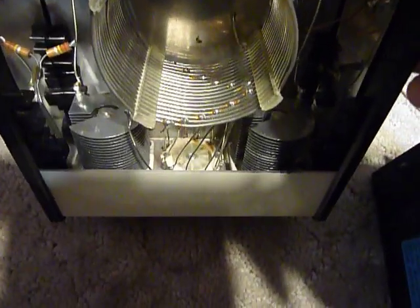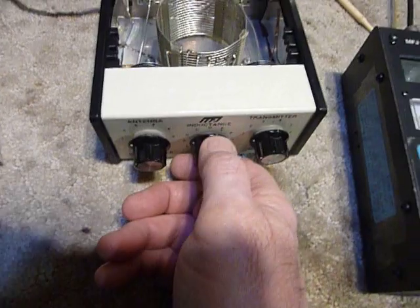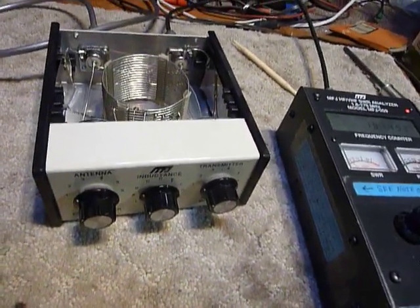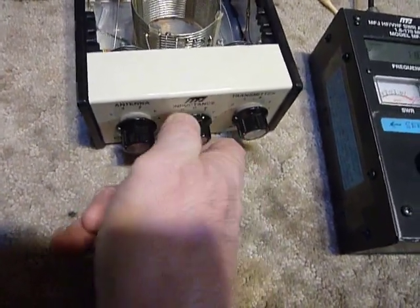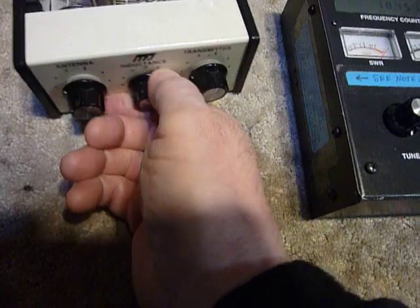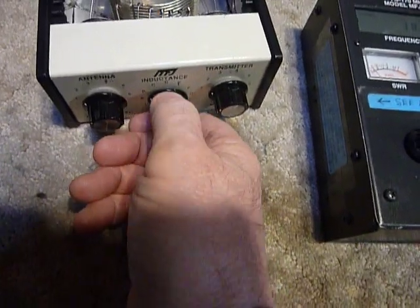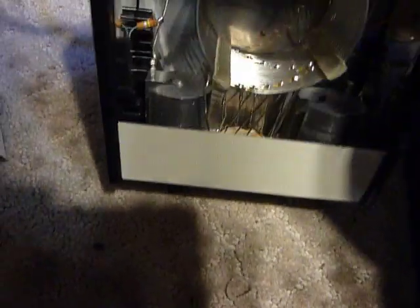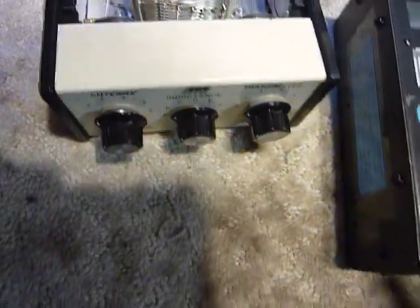This has got a white rotary switch — you can see it down in there. Those rotary switches are made to clean themselves when they're used, and if you don't use them enough they don't get cleaned properly. So if you buy one of these, I would recommend that you just turn it around like that — 25 revolutions forward, 25 revolutions backwards — and those contacts will wipe themselves clean. You really can't get contact cleaner into those plastic switches very well, though there are a couple of little holes and you could spray a little DeOxit in there.